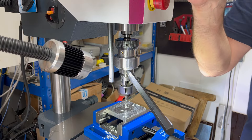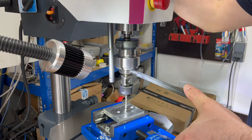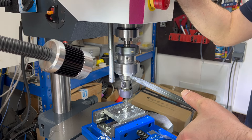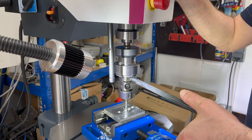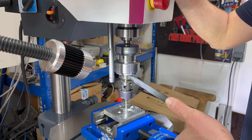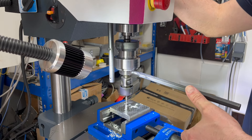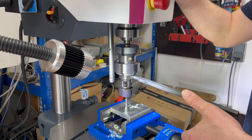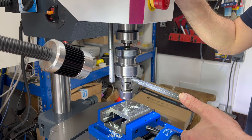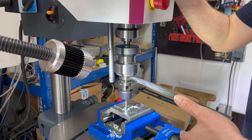I have already seen many videos where people complained that the table moves in all directions — that is logical, so you must clamp this table, just like with all other bench drill machines. Then I set the lowest speed, which is 80 RPM on the OptiDrill. And as you can see, you can then start cutting the thread. The slight wobble that you see is because the chuck has a certain amount of play — but once you are inside the hole, it disappears.